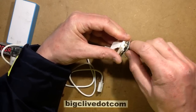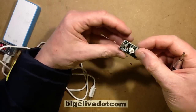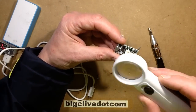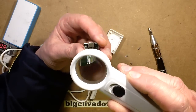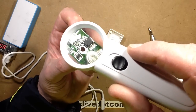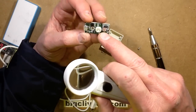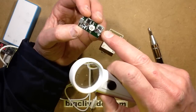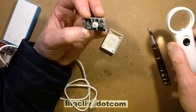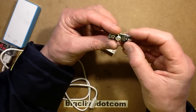I don't know if there's a timer in it — I didn't actually try that. What have we got? We've got the magic little 8-pin chip that just appears in everything, but it's possibly not the same one every time. I don't see a number on it at all — none of them ever has a number. It's got a little transistor to switch the LED. It's a typical sort of 1-watt-ish style LED, and then it's got a big fat 3.3 ohm resistor. So I'm guessing there's no fancy current regulation — it'll just be this little microcontroller acting as probably a timer.